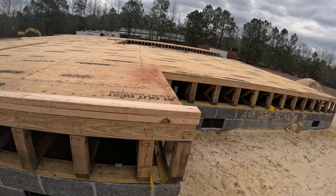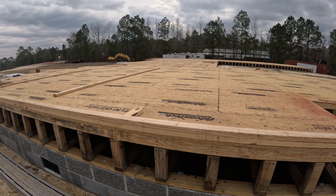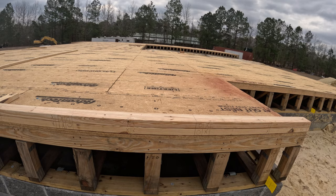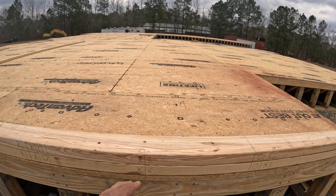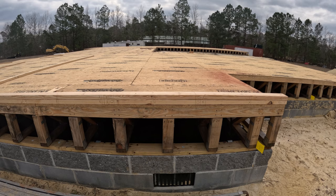And one of the things that I do, which probably not too many people do, I don't really like doing the wall sheathing vertical. But down here, they make you do it. Otherwise, you have to put all these blocks in at every joint, which makes no sense. But anyway, rather than break a 10-foot sheet vertically on one stud, half on and half off, I do a double stud every 4 feet. So my sheathing has full bearing on a stud and they are nailed together. So it's much stronger that way. So that's the way that I do it.